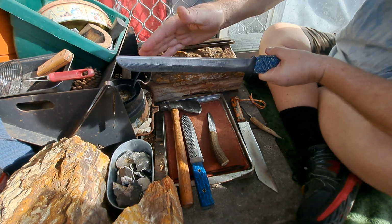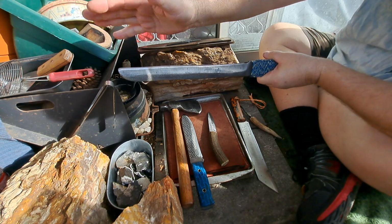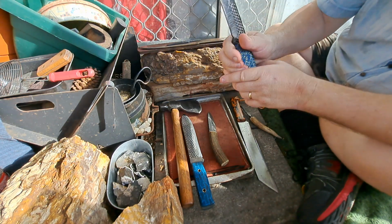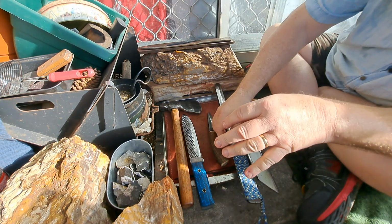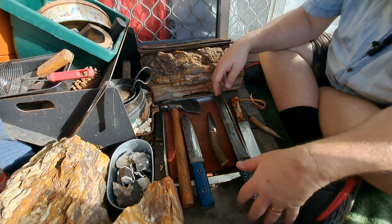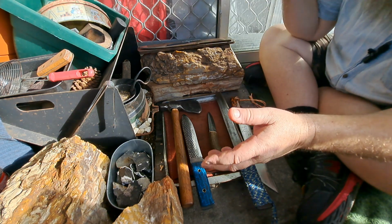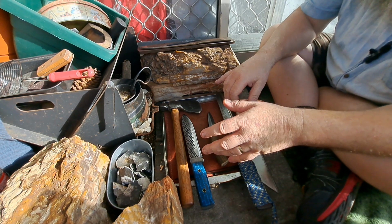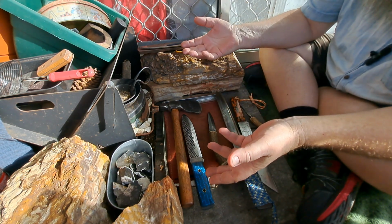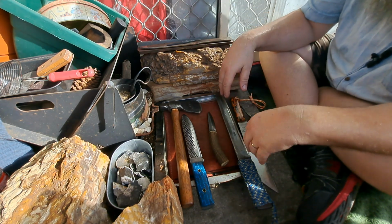It was just the way the grinds went. I think it got a little bit hot up here, and Andrew had to step it back. Just the way it goes. That just happens, and that's fine. It was no dramas. As I said, sometimes it just happens when you're grinding. You go near the tip, it gets hot, goes blue, ruins the temper, and you have to grind it out, and away you go.